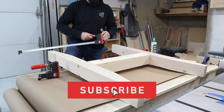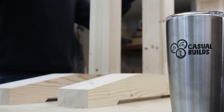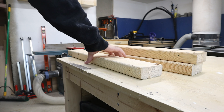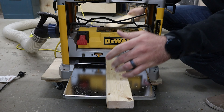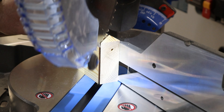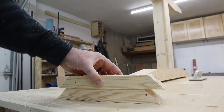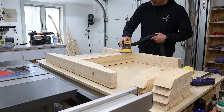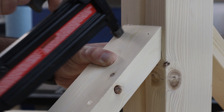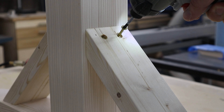At this point in the build, I was loosely following my plans — kind of just making things up as I went and adjusting the 3D model based on what I'd already done. For the 45 degree support pieces, I wasn't sure how long they needed to be, so I placed the leg assembly on some construction paper and traced it out with a pencil, drawing in the lines for the support braces to figure out the best length. I took some scrap 2x4s through the jointer, planer, and table saw to bring them all down to the same width and thickness. Then at the miter saw, I cut a 45 degree angle on one end of each piece, set up a stop block, and cut the other side. Now is a good time to get some sanding done too, because once you attach these pieces it's difficult to access the space between the braces. The easiest way I've found to attach them is adding glue to the ends and using a brad nailer to hold them in place. Then I drilled two holes with a 3/8 inch drill bit, screwed in a screw, and plugged them up with some dowels.